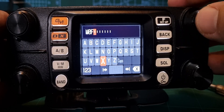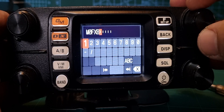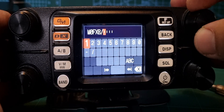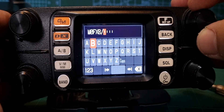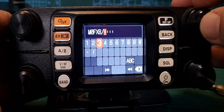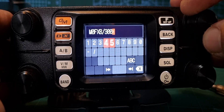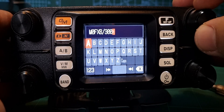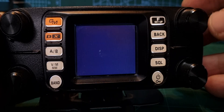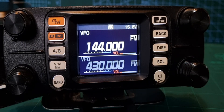Spell out each letter — F, X, B — going the quickest way, then select the slash. You can put up to four digits after the slash and it will work on C4FM. Without your call sign it wouldn't work on C4FM anyway. I'm putting in '300' for the FTM-300 and then 'D'. Hold down the channel knob and it will reboot. When it comes on it'll show your call sign and '300D', and your APRS details will show up there too.